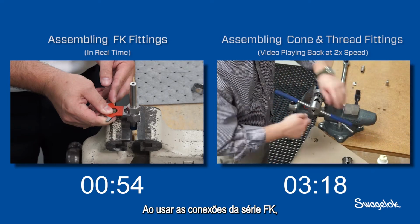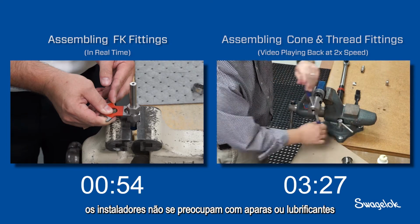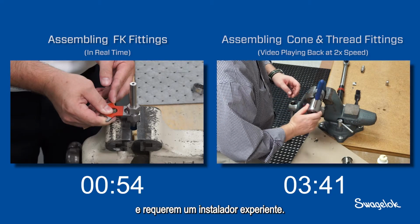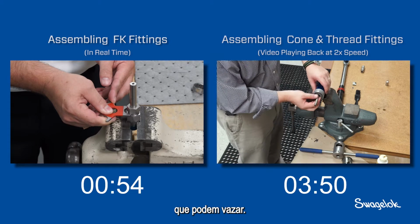When using FK series fittings, installers do not need to worry about shavings or lubricant as a contamination risk. Proper coning and threading is a skilled process and requires a knowledgeable installer. Inexperience can lead to improperly threaded connections that can leak.